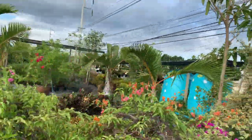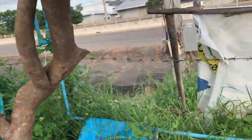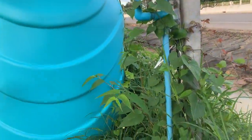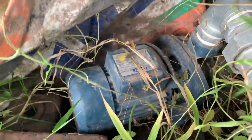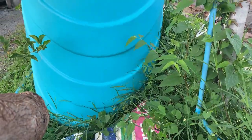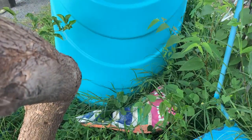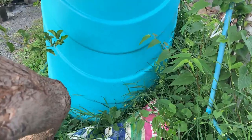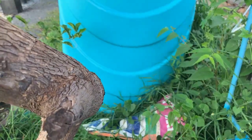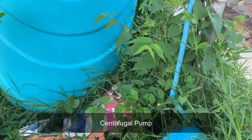The first line I'm going to show you runs back to the pump. As I said earlier, the pump is not automatic — it doesn't come on when you turn a valve on. It's a simple one-horsepower centrifugal pump that comes on and off via direct power. It pumps in through a one-and-a-half inch line and pumps out through a one-and-a-half inch line.